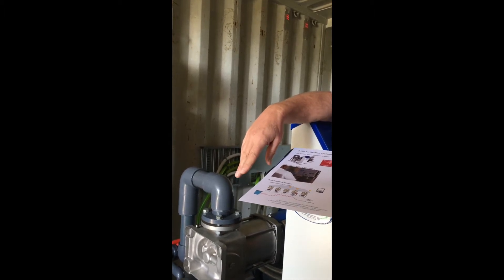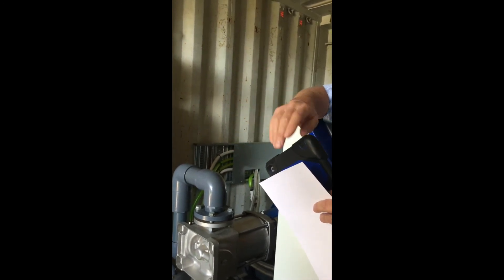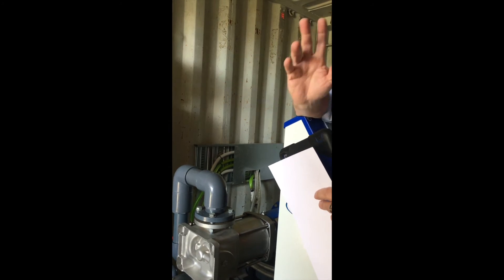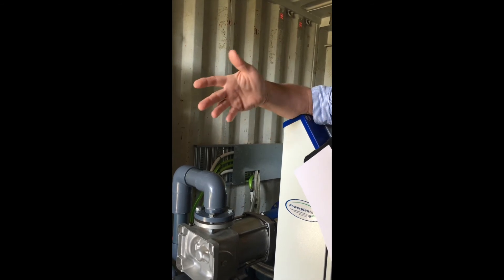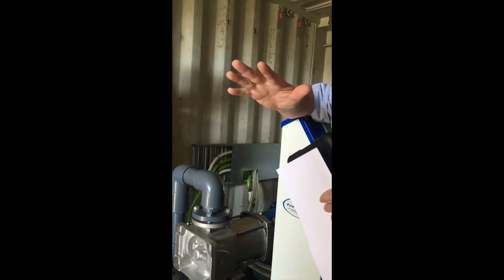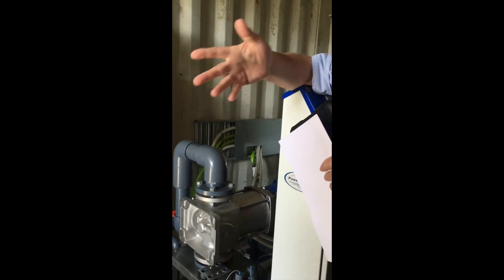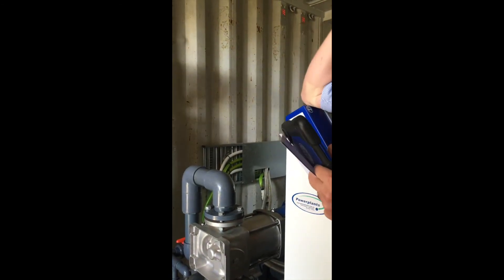These systems are designed so you can log in remotely and wander around your farm with an iPad. You can turn irrigation on for a specific valve at that point without waiting for the radiation sum to trigger it. You can also activate a valve not just once but up to 20 times, so if you're buffering bags, rather than telling it to irrigate one at a time, you can get a large, solid amount of irrigation water out of it. They are a complex system, but the interface is pretty user-friendly. We do support our growers by getting out there and making sure they're using the system to the best of its potential.